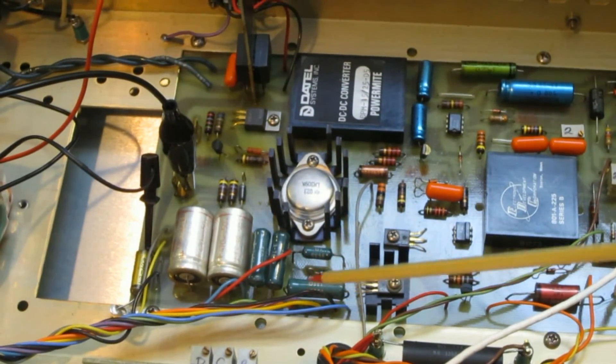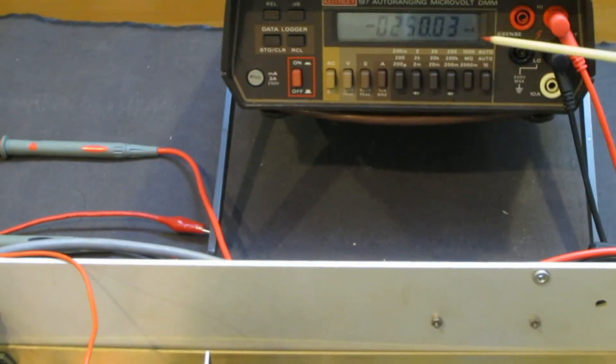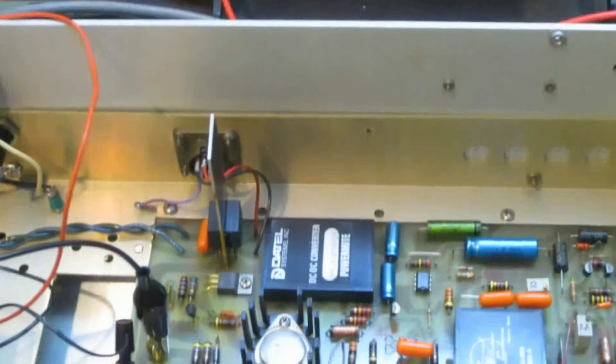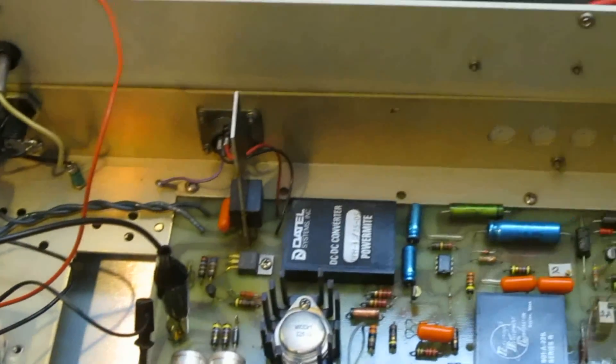Obviously, I don't think I would want to keep the battery in this device. I probably will use it as external only through this external amp connection. The reason for that is this unit was not designed for lithium-ion battery charging, so it could be taking excessive current through this battery and damaging it. Also, a lot of the older units take either a floating charge approach — charging a nickel-cadmium battery or a lead-acid battery — which are more tolerant to overcharging at a floating level. So nevertheless, we kind of figured out the battery option of this unit. I hope you enjoyed the video, and I will catch you next time.